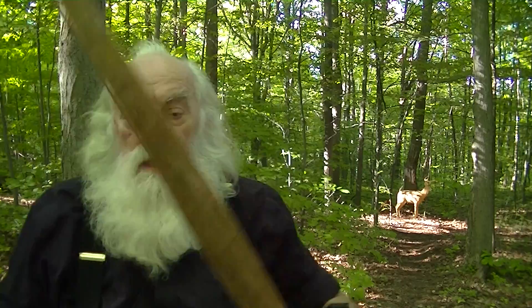What I did was I tillered it until it was about 26 inches. Then I just scraped it 10 times, pulled it, scraped 10 times, pulled, and I kept scraping it down on each side until I can just get it back to my lip. That's a short draw to the lip, but because it's a heavy bow, it's very powerful, so it shoots just fine.